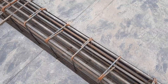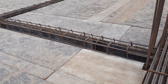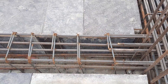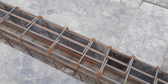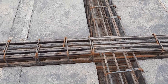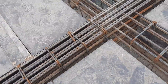Here the spacing is about nine to ten inches, but it should be between 100 to 150 mm — that is four to six inches. Four inches or 100 mm spacing should be provided to the distance of L/4 where we have negative bending moment. After L/4 you can provide 150 mm, but unfortunately they provided about 300 mm or sometimes 250 mm. You can see the extra steel rods they provided here. The spacing of the column is about 22 feet.